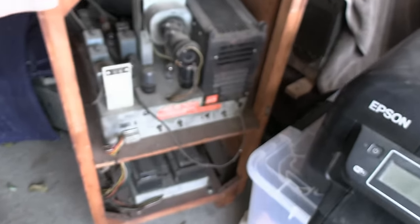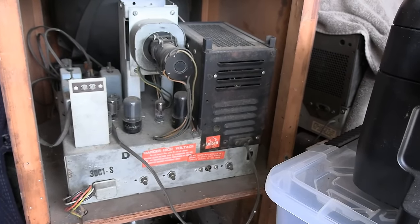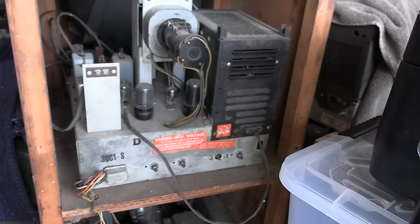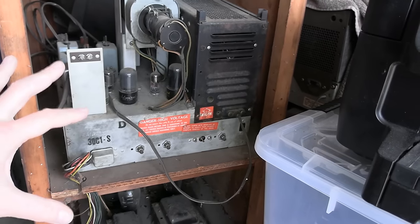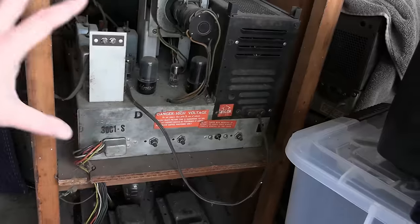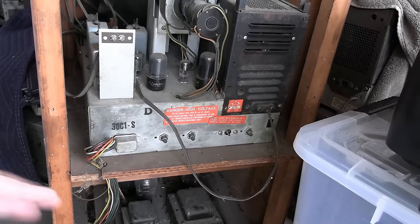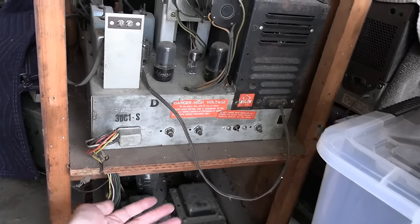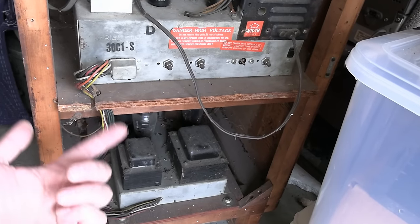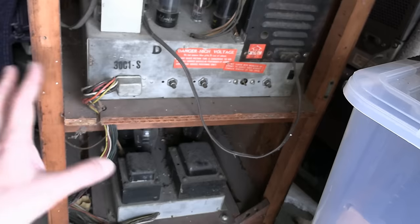In the past I was more hesitant to say never plug it in — if you've been watching my videos you've seen me plug plenty of things in as-is. I still wouldn't do it with this set without being able to look underneath the chassis first. All this looks fine from the top side, but I have no idea what's going on underneath. Some sets have cutouts where you can get underneath, get on your back with a flashlight and check it out. I really want to get this thing inside and on the workbench before I think about doing anything more with it.